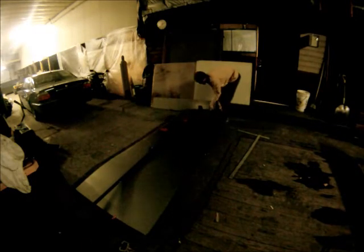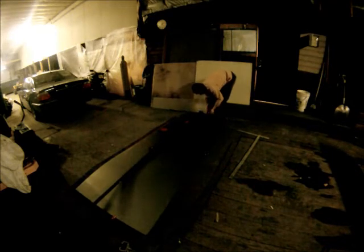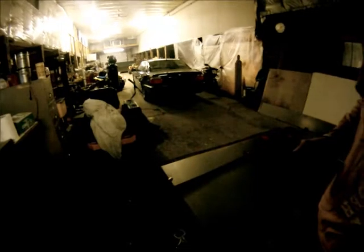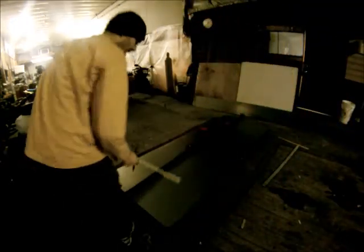I had a couple pieces of square tubing to help support the ends. This isn't ideal. Also make sure that you don't clamp your ground to the part of the work that's going to fall to the ground or be separated from the main structure. You ideally want the ground to stay with the main piece.